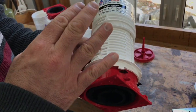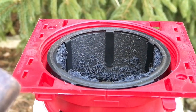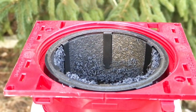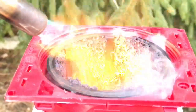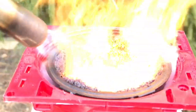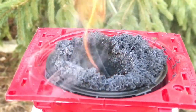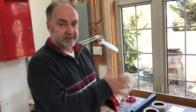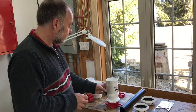I want to show you a little bit about what that stuff looks like when it actually gets hot. The torch I'm using to heat this intumescent ring doesn't deliver the same overall heat as an actual fire does, but it gives you a sense of what this material does when it gets hot — it doesn't actually burn, and it does expand, as you can see here. If I had kept heating, the intumescent material would have sealed this off completely. The system has some other features too, like extensions that can be threaded in and other details.